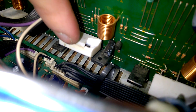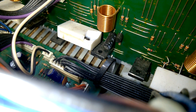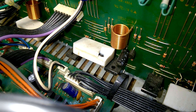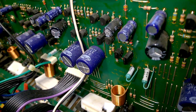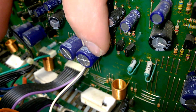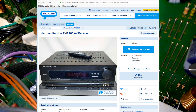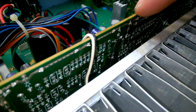And here is the reason why: we have an emitter resistor here and it is broken. The reason why it is broken is usually a faulty power transistor. I could probably change the power transistor — maybe this will work — but there could also be a broken driver transistor. The whole unit, if working, is not worth 50 euros, so I really have to think about whether I want to invest time and money here.